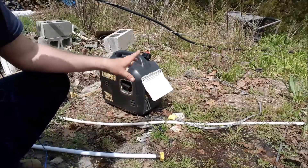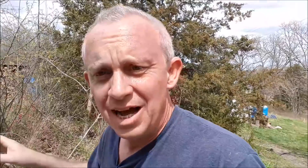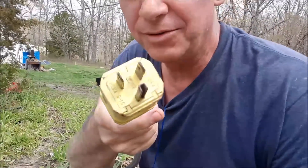That little tone change is just because it's not having to use as much energy. Another option is a solar-powered DC direct-current well pump — they're a bit more expensive. The difference between AC and DC: AC is what you plug into your house, which also plugs into the generator — that's alternating current. Your car is DC, 12 volts. These DC pumps you usually have to get in 24-volt; I like 12-volt because it's easy to adapt to your car.